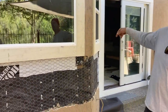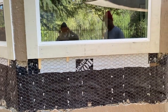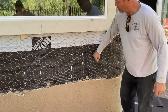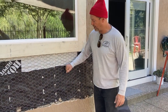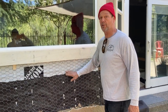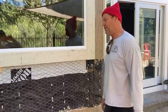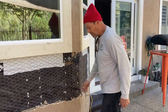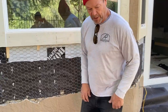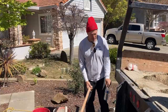Okay guys, this is the wall we're doing today - it's a repair. They put three new windows in and decided to use wood trim around the top and the side, so we're just doing this section here. It's open stud construction but I have line wire behind there, there's insulation giving it support. I've got plenty of material on the truck. It's really just a three-coat system and we're going to go outside right now and start mixing.